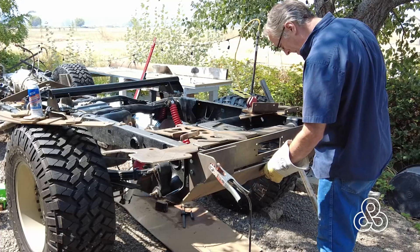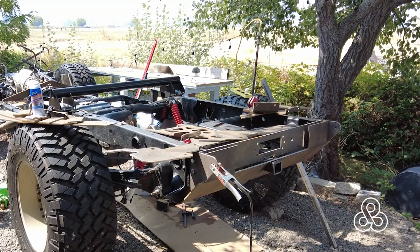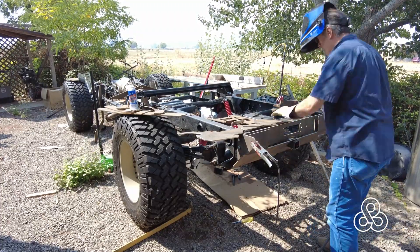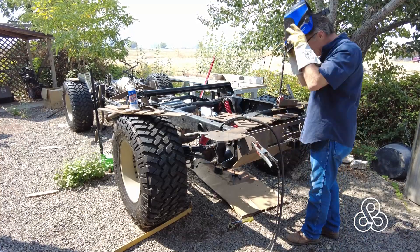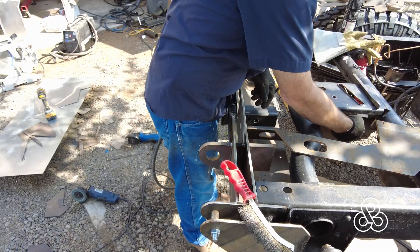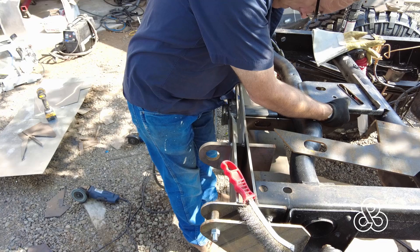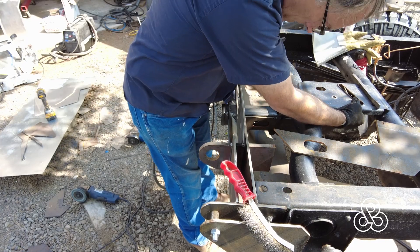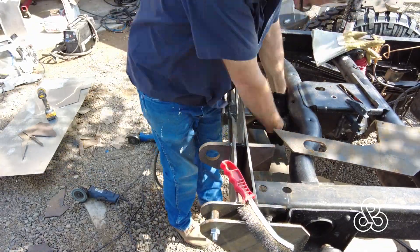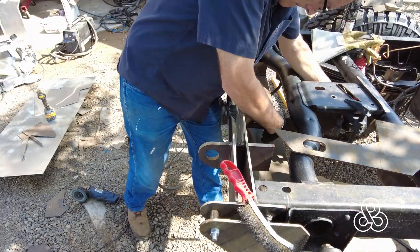To make a serious heavy duty pull-point bumper, we're going to use a couple of quarter-inch steel plates running parallel to each other as the main structure of this whole thing. The outside plate actually has a couple of bends in it, coming down 45 degrees and then 45 degrees to bend underneath the vehicle. Since there are some heavy anchor points, we're also going to have a good anchor in the pintle hook receiver. This receiver is going to have a couple of extra plates added to it, welded to the sides, and then brought up and bolted to this plate that goes between the two round cross tubes in the chassis.